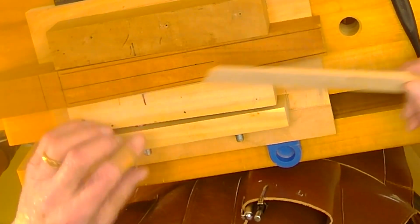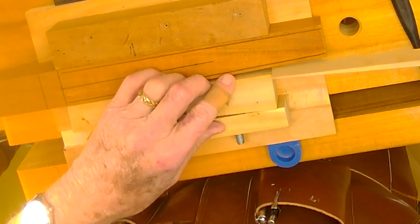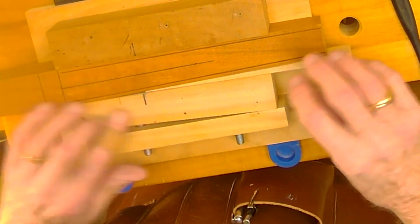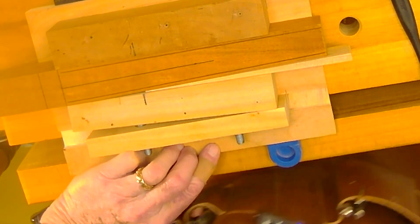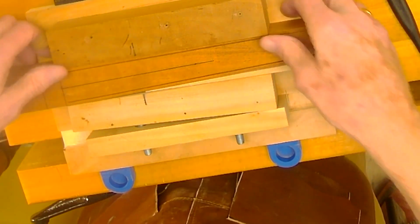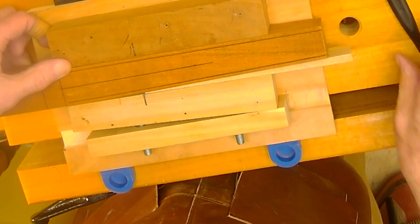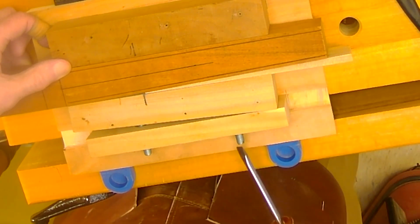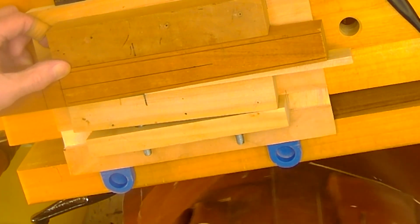So now I put this in on the tapered side so that I can get the leg pretty well square. Now this particular jig, I made this jig. I know when Roger taught his class, he just had one he just clamped together with some wedges. But I tend to like to make things work a little bit better. So I make them adjustable so that they're useful.